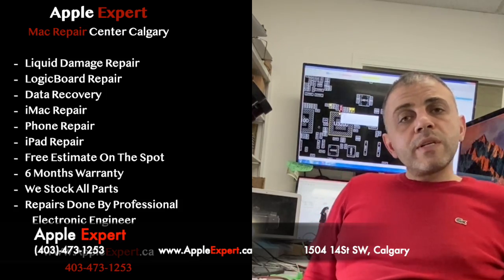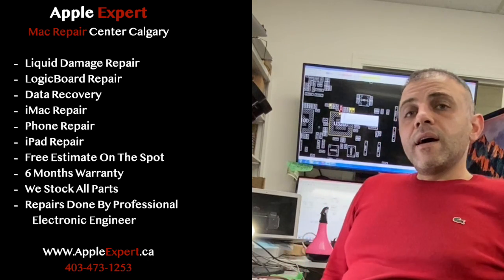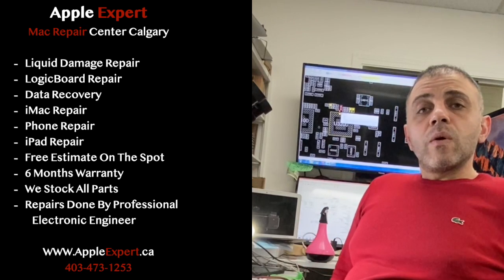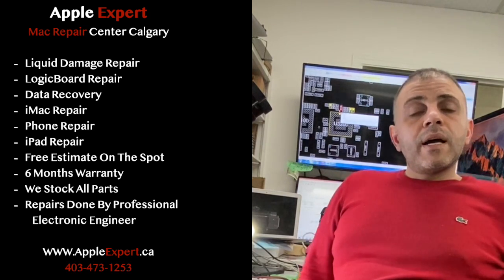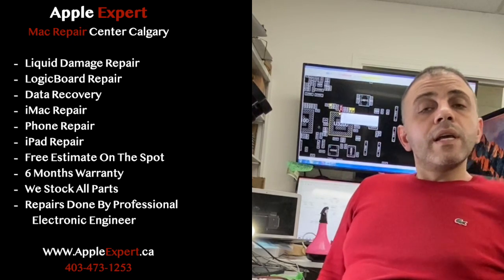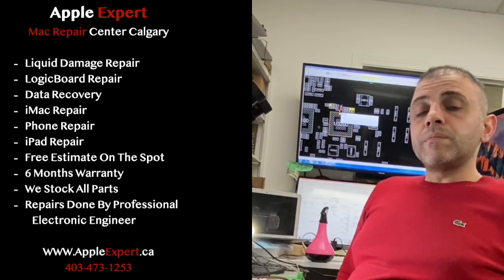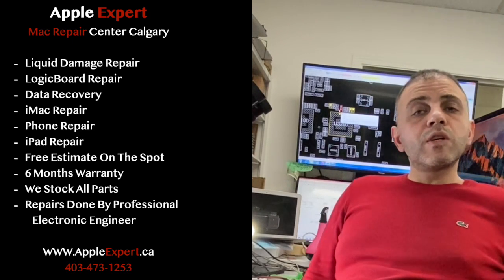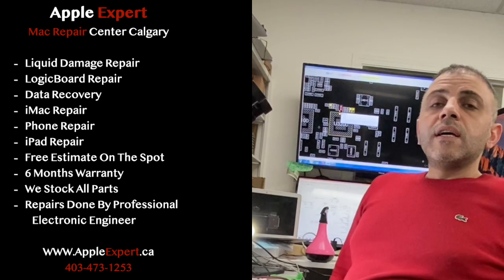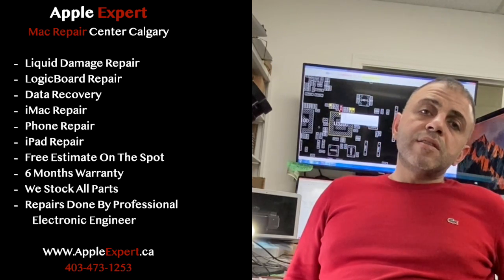So I removed a USB-C controller from another logic board, a donor board, and I retinned it manually. I soldered it to the logic board. Then I got my 3.3 volt there. Then I got the laptop working again. So what I will do after that, I'll remove the chip again, rebuild it properly, clean the logic board, clean the entire laptop, and call the customer.